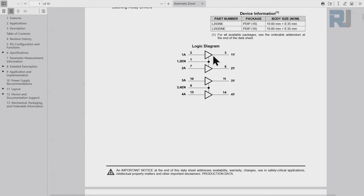Now select the port. If you click it and see two ports and don't know which belongs to your device, right-click the Start menu and go to Device Manager. Under Ports, you'll see USB Serial CH340 and another USB Serial Device. Disconnect your board - whichever port disappears is your board's port. Reconnect it, note the COM number (e.g., COM8), then select it in Tools > Port. Selecting the board and port must be done first.